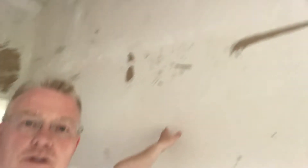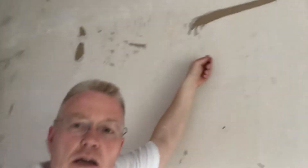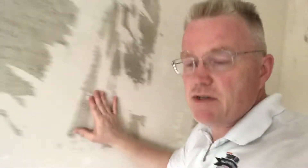The walls were not prepped at all. Over here when I pulled the sheet off, I didn't even touch it — the skin on the sheetrock just came off. This is the most difficult wallpaper removal I've ever done because it caused the most damage. If your walls look like this, don't blame yourself — it's because the walls underneath the wallpaper were not primed properly.